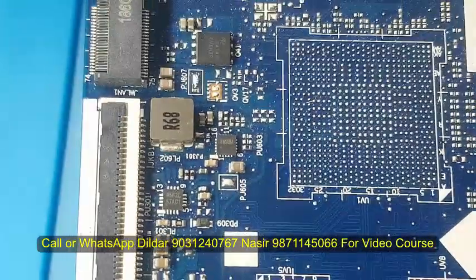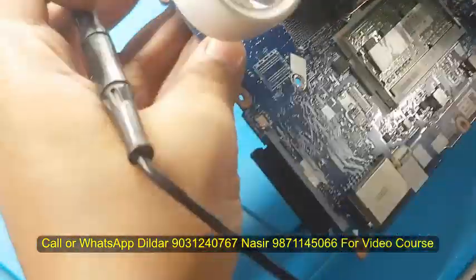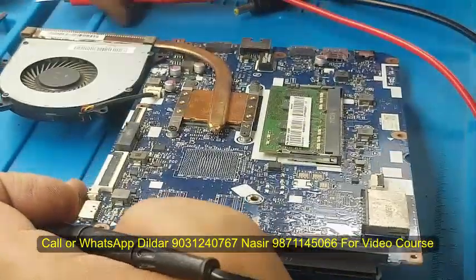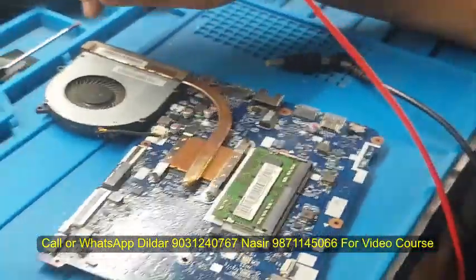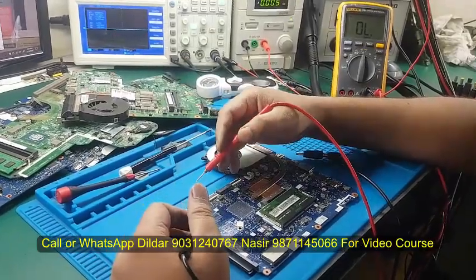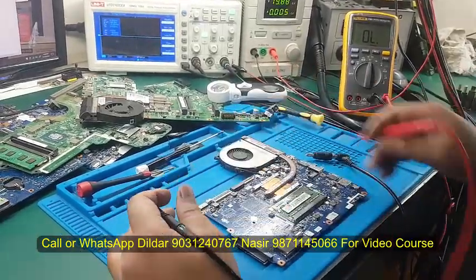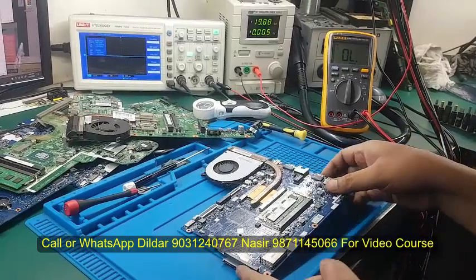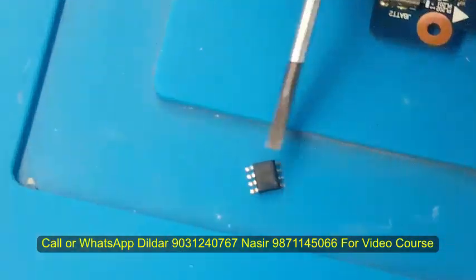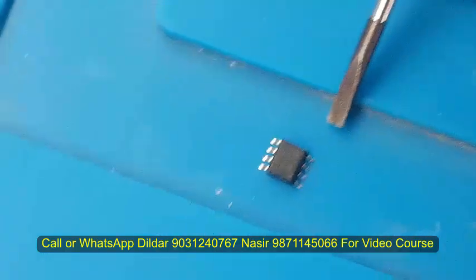So the IC was also here before. Now we will replace it. We will see which channel is here - we will confirm which channel will be used. We have also added a video in our tutorial to confirm whether you need to insert this channel or the other channel - shorting process and hot checking. Let's go ahead and change the MOSFET. After that, we will see what the condition is. As you can see, I have changed the MOSFET. The MOSFET number, if you can see, is PV-507BA.